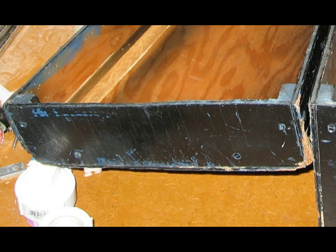A case such as this is at least inexpensive and readily fabricated by anybody with even a few hand and power tools available to them, but it does have some other fairly severe shortcomings, in my opinion, one of which is illustrated here. The plywood always ends up being exposed along the edges and corners, and these are the areas that take the most abuse. And plywood tends to delaminate fairly easily and splinter on its individual layers, leaving a very ragged set of corners and edges that quickly deteriorate, catch on things, cause minor injuries to people, snag clothing, and cause other issues.